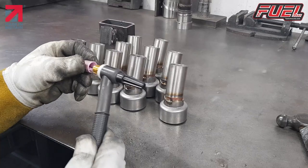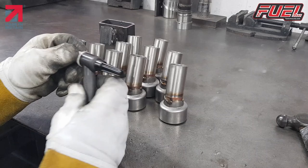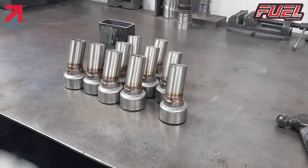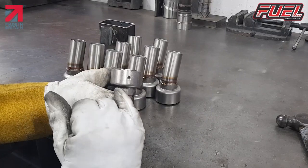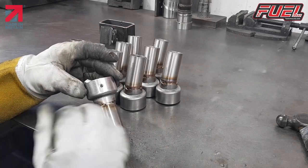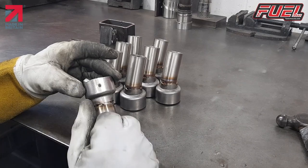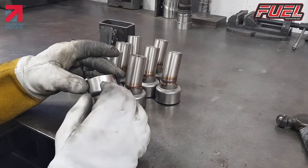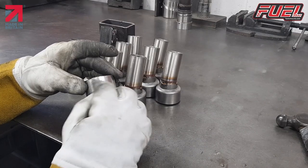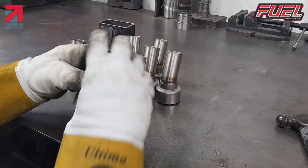Not for any other reason other than what I'm going to do now is I'm going to be tacking up, putting a small tack on our riv nut inserts here. Now the riv nut inserts, because they're slightly proud, what we do is we grind these off, but I like to put a tack of weld on each side because it's a boot and braces thing, because even if we were to dish this DB killer and sink it in and not weld it, I still believe these will probably still move. So I like to put a weld on these.